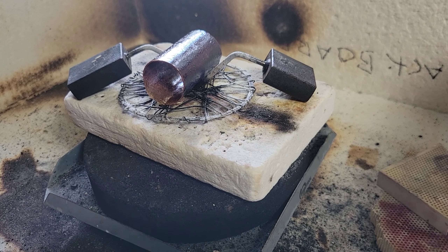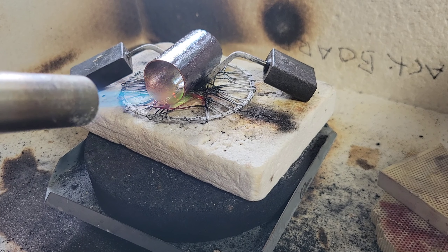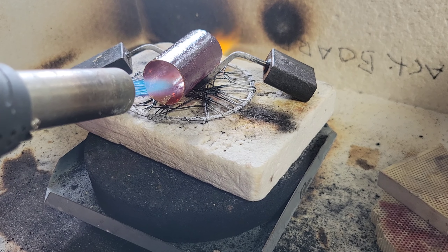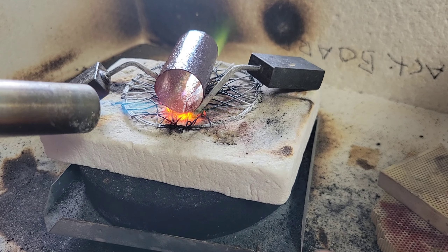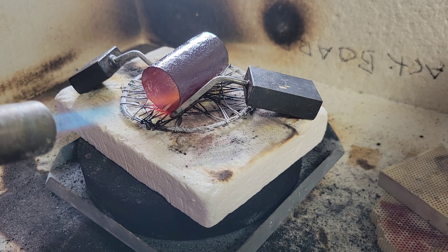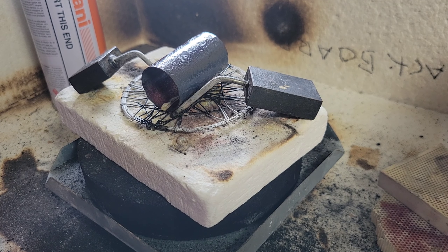Super cool green flame. I think we got it — no, we didn't. You can see the solder starting to turn like a little mercury, but I thought we had it — now we need more heat. So I'm now focusing and you can start to see the copper glow. I don't want to overheat it — it's not going to shrink but it will expand, and if it's too loose it's just not good on the shaft of the fantasy weapon. Okay, we're getting closer. And when it does happen and I take away the flame, you're going to see the solder — which looks like just a line right now — just flash. And there we go, boom. You saw it grow out. Look at that super neat grayish coloring to the copper — that will come off, we can polish it.